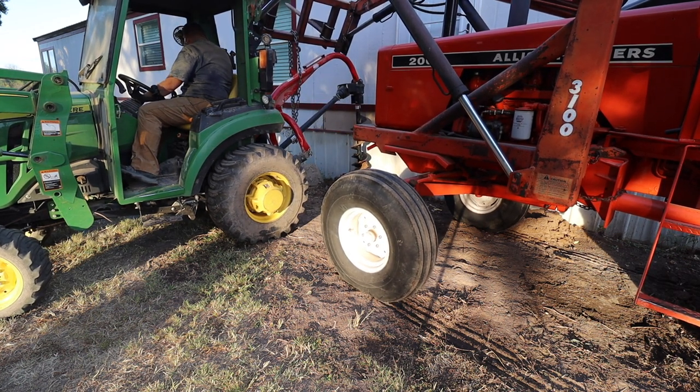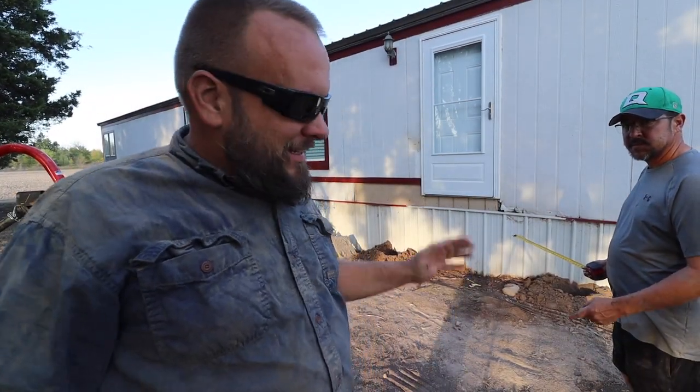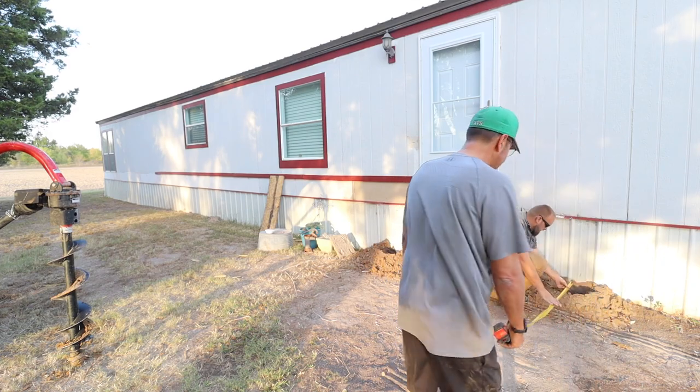The two tractors could not pull this out of the ground without me spinning the PTO, which is hard on it, starting it in a bind. That felt like an exact recreation of what I saw in the operator's manual for this. Center, very center.